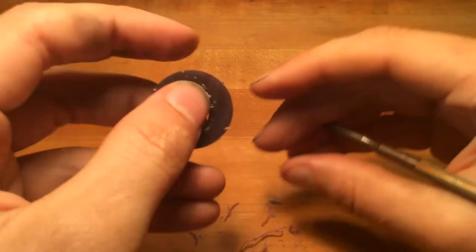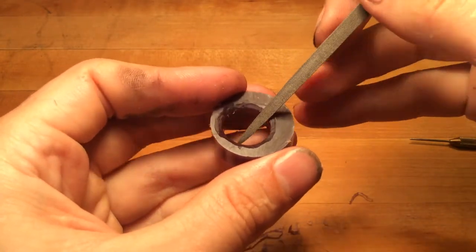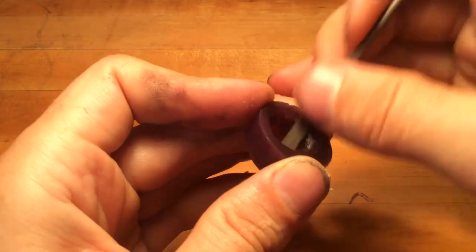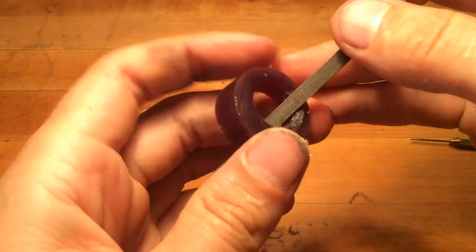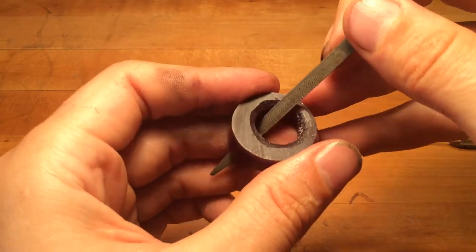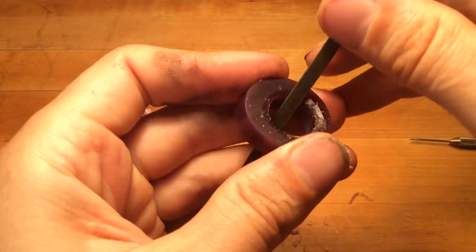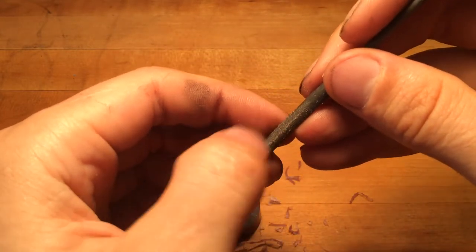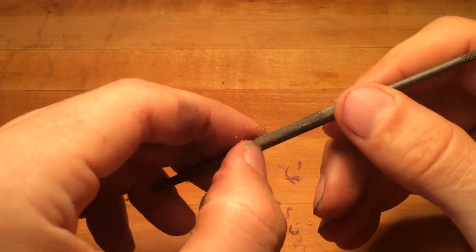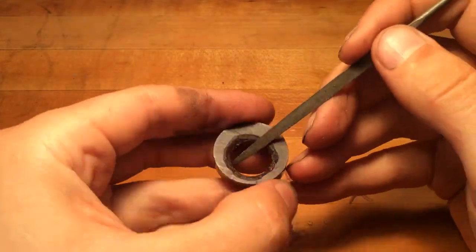The thumbnail works really well. Or if you have the half-round needle file, find the right angle so that you're not stabbing your wax — this works really well. The file is only going to cut on the push stroke. Make sure you're not rubbing it back and forth so vigorously that the wax heats up, because that's going to clog your file. You'll need to use a nylon toothbrush or your fingernail to clean out the back of the file. If you go too fast and melt the wax, it's really hard to get out and you'll have to run a small tool through all that texture to break it loose.